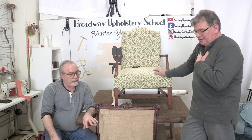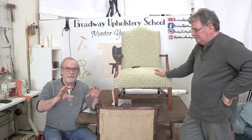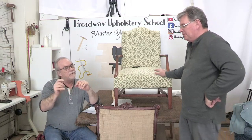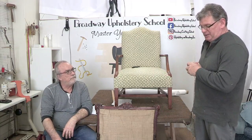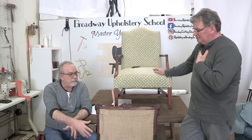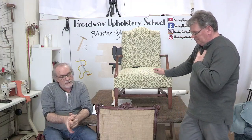Jimmy had to do edge rolling and properly put it on. That was an education - he hadn't done edge rolling in quite a while. Unfortunately what Jimmy had in there originally that we can't use was a beautiful coconut fiber stitched front edge, about three or four inches thick with all these hand stitches - those didn't fare well. But this new setup will enhance the years of this chair - probably at least another 20 years, actually more. The fabric will wear out and you can upholster over what was done three or four times before you even need to touch the underneath part.